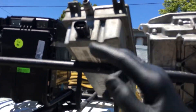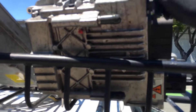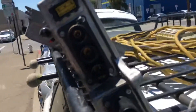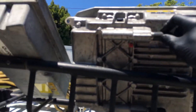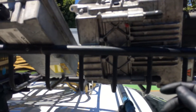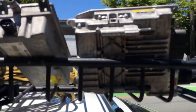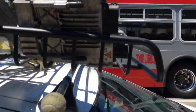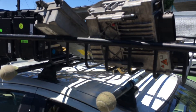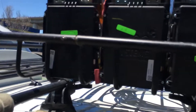This is the inverter — it takes the batteries and inverts the power to be used on the motor. They're coolant-cooled, not just radiant-cooled. I can get a radiator from one of my shops during a repair pull, get fans for free, and build my own glycol coolant loop. I can also get plate heat exchangers and air-to-water heat exchangers slightly damaged out of cars — all for my solar battery-backed system, almost all for free.